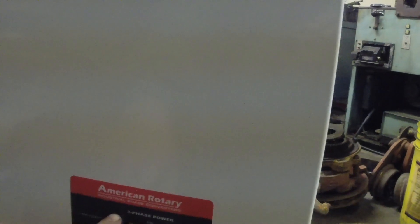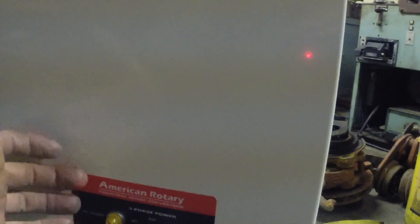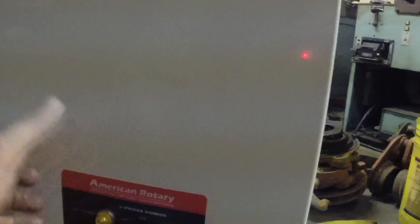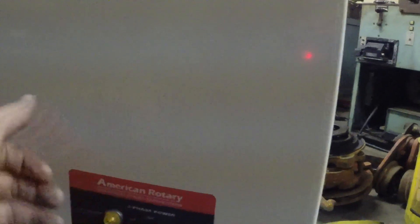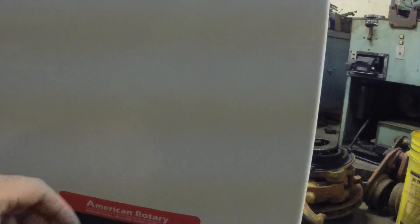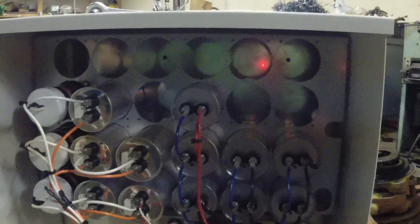This is set up so it's got single phase power feeding through it all the time. But I find usually because of the caps you don't get balanced power voltage when this is either running or off. So I don't like to run any single phase stuff off a phase converter — I prefer to have separate power feeds for that. I'll just use this for three phase power. I may even run it into a transformer and bump it up to 480 volts so I don't have to run as big a gauge wire all through my shop, since it's gonna be a lot of high amps.